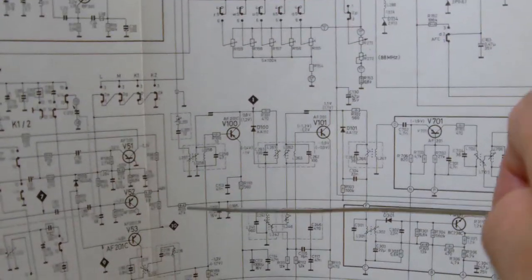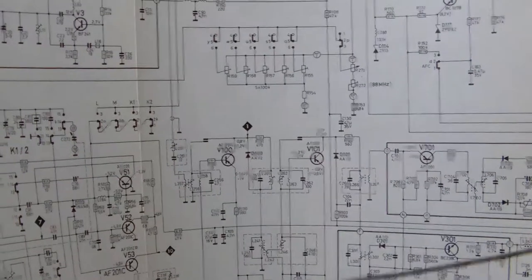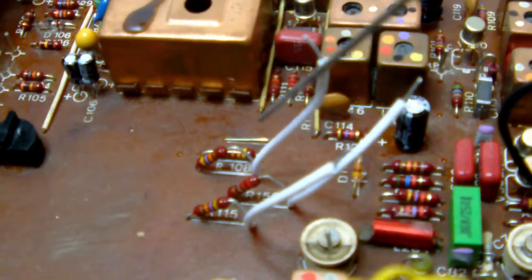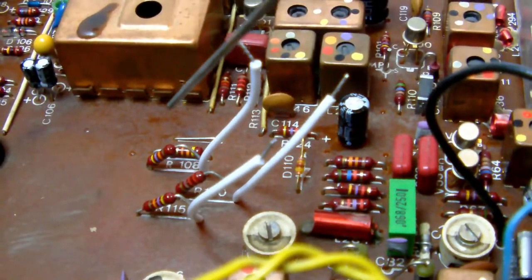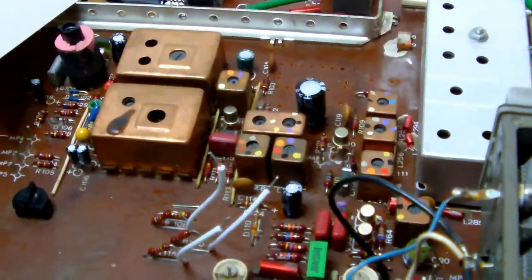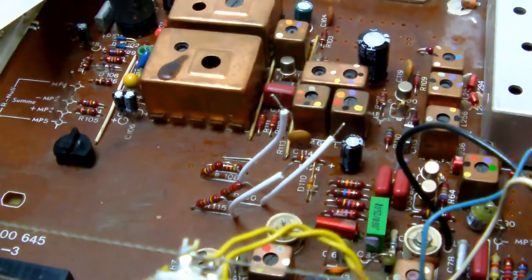So, I choose components which are located at a, let's say, strategic point within the whole circuitry of the tuner. And lo and behold, the designers of this tuner placed those specific resistors at a very easily accessible spot on the main PCB. So why do you think they did that? Well, exactly for the thing that I'm trying to do now, namely to localize the problem within the larger PCB. Alright? So that's how I choose the components to unsolder or resolder. So I just interrupt the flow of the B+ at crucial strategic points.